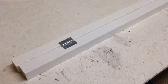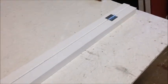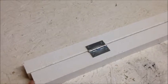With a 42.5 inch piece and a 43 inch piece, create the upper truss of the roof panel. Take the 42.5 inch piece and nestle it with a quarter inch overhang on either side, then install the two hinges.